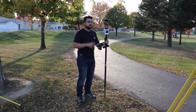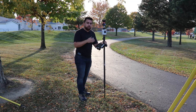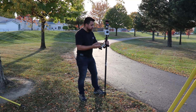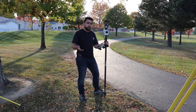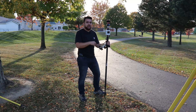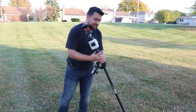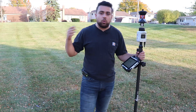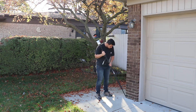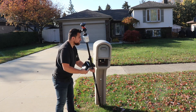Another benefit of the AP20 is the efficiency in which we collect data. Making sure you stop at every single point and ensuring that your rod is plumb will take several minutes, whereas if I'm able to just take an observation on the fly knowing that my compensator is working, I'll be able to do a topographic survey much quicker because I know that my positions are being calculated correctly and I don't have to worry about plumbing the rod at every single shot. Having the ability to take a measurement on a slanted angle means we can now observe positions of points that we couldn't have with a traditional rod. This can include building corners rather than taking a reflectorless shot or doing an offset, or manholes underneath cars that we need rim elevations for, or anything with a base that would be very difficult to grab by holding the rod plumb.